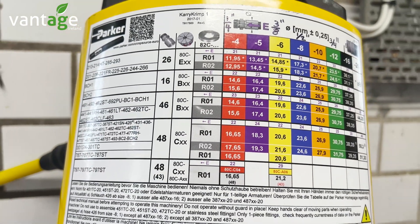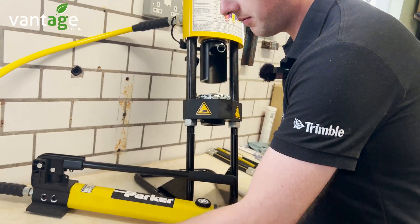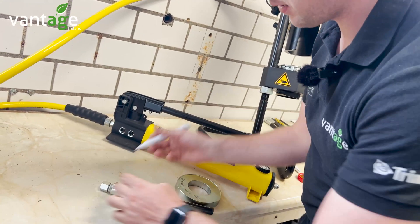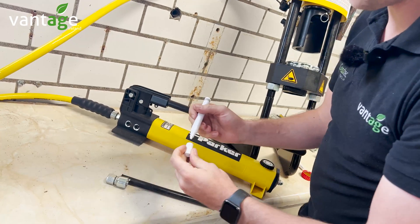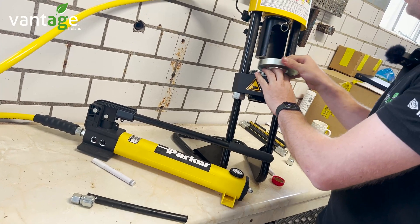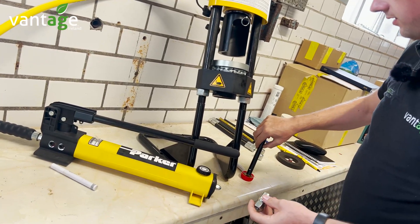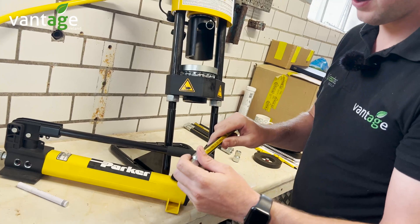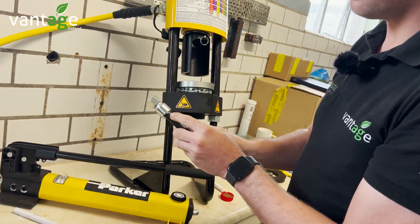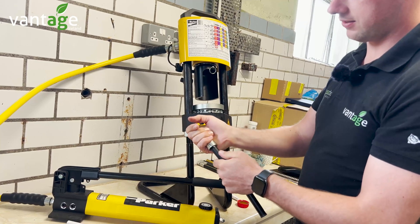To repair your hose it's very simple — you have your hose and your connection. First of all, we'll mark on the hose where we want our connection to go on. Then we'll put it on top of our dies. Dip the hose in a small bit of oil just to get the connection on, push your connection on until it goes up to the line that you have marked, and get it hand tight onto the hose.